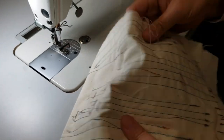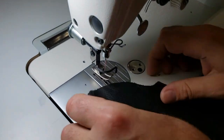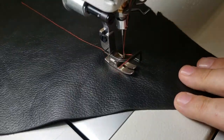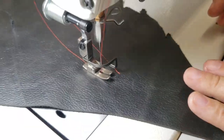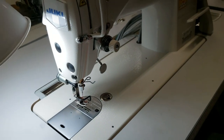Now this is modeling two or three layers. Some people call for leather — by the way the needles are 16x257 in all different sizes and the thread is T27. Look at that — beautiful stitching. This is real leather. This one is really good. Now I change the stitch length — see how nice it shows. Now I'm going to do a double row — two beautiful stitchings on leather.